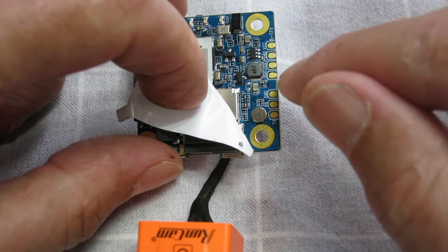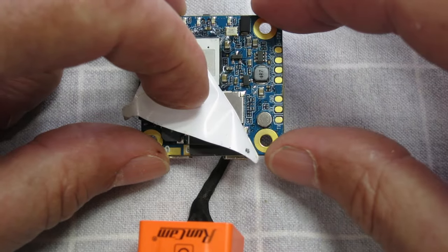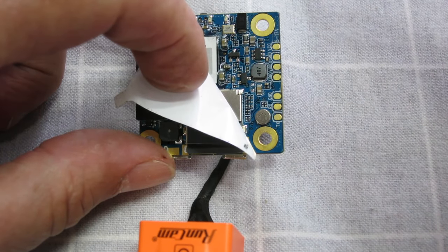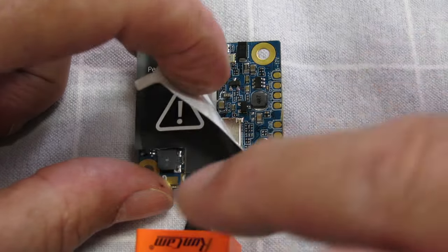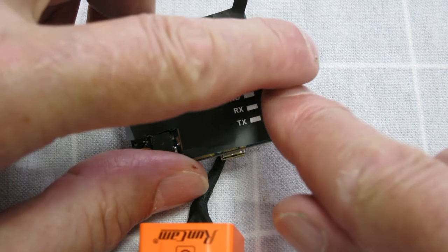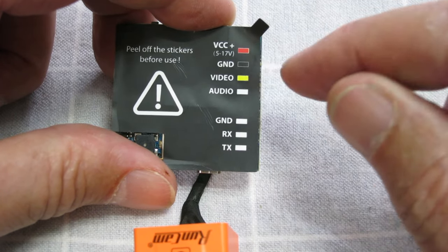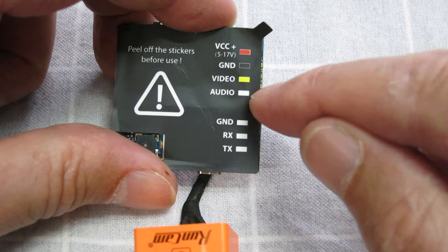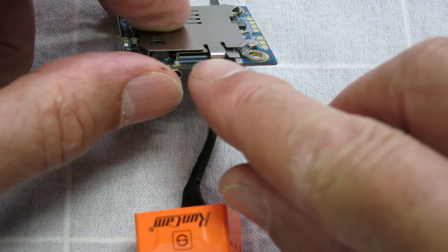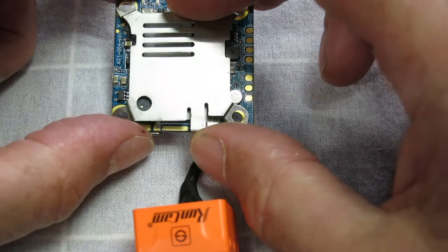It's specifically designed to connect up to flight control boards and can be configured in Cleanflight. At this stage, not BetaFlight or INAV as far as I know, but the firmware is coming for that apparently. So you can change mode and start/stop using your transmitter through your flight control board. There's a little buzzer here, and these pads connect to your flight control board. There's the microphone. Here we connect to the flight battery — ground, and video and audio going to your video transmitter. We also get a little cover which goes over the top, acts like a heatsink, and also stops your card from popping out in a crash.